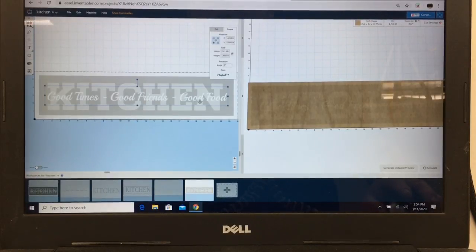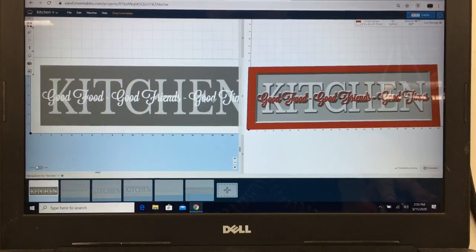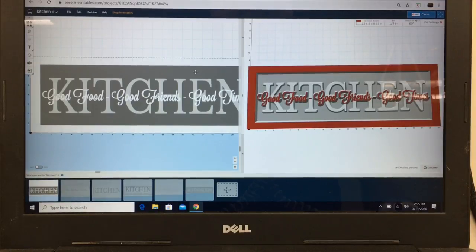You can see that in just a very few minutes you're able to create this type of sign and it does look great. Just remember you can play with these different depths to get it to look exactly the way you want. The only thing to keep in mind is that the top layer written in script is always going to be at a zero cut depth. The next layer down — your background word — is going to be about half the distance to the full depth of the pocket. Keeping that parameter in mind, you can really do anything you want to get the desired look.